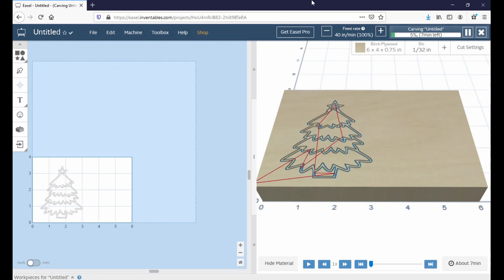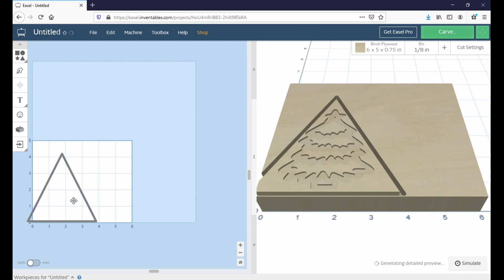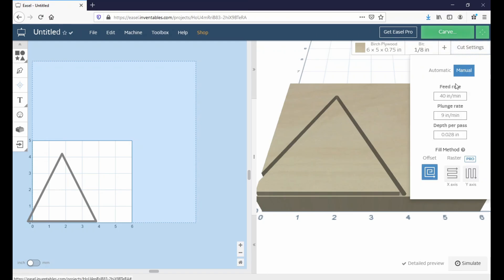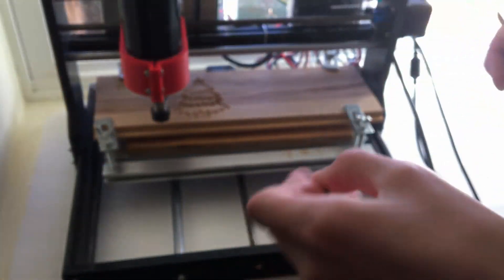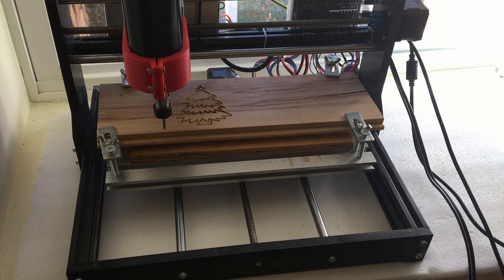Now we will repeat the same process of creating a design in Easel and carving it, but this time we'll cut out the outer shape of the ornament. Back in Easel, we will choose the shape we want to cut out — in my case, I'll choose a triangle because it fits my Christmas tree well. In order to cut all the way through the material, we will set the cut depth to be slightly deeper than the thickness of the material on our CNC. For this cut I will be using a 1/8th inch square end mill. I will again use slightly higher than default feed rate and depth per pass because I have an upgraded 500 watt spindle. After clicking carve, we can change the bit to the end mill and set the zero point of the CNC once again. This zero point should not be moved from where the last CNC operation ended, so both operations are lined up with one another. To switch out the bit I had to move the work away from the cutting head, so I kept track of how far I moved the CNC and moved it back after I was finished swapping out the end mill.